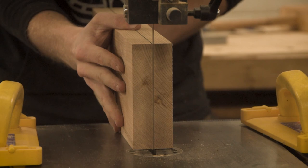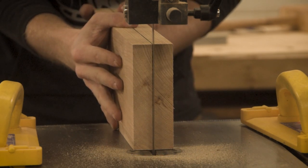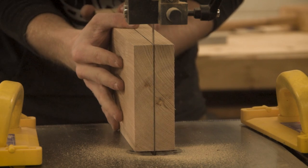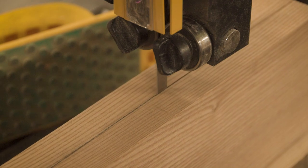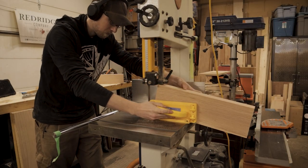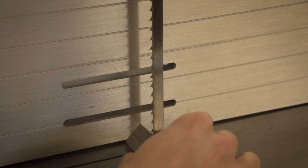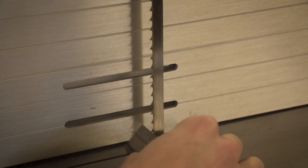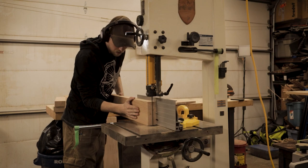So right now, as I'm preparing this stock to make up our case, I've decided to do a little bit of book matching. Now this is mostly out of convenience rather than going for a book match. If you follow me for any amount of time, you know that I'm constantly book matching stuff, not always for the purposes of having a beautiful book match, just because it's a very efficient way to use material, especially 8-quarter stock. So our side panels are going to be made from a book match pair, as well as our middle shelf.